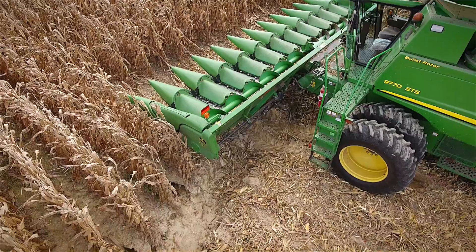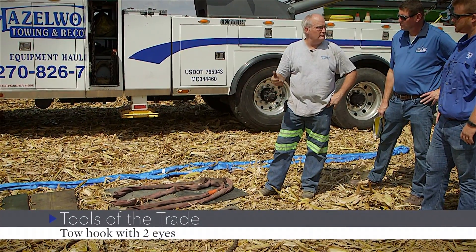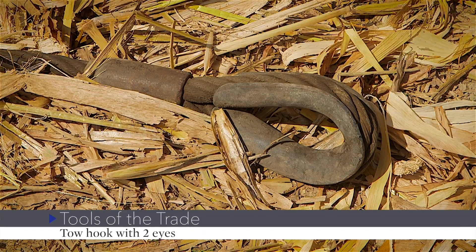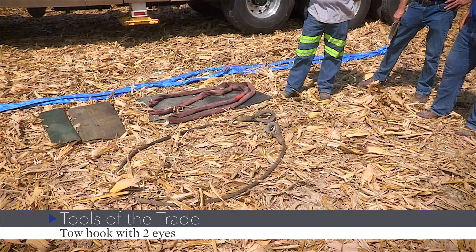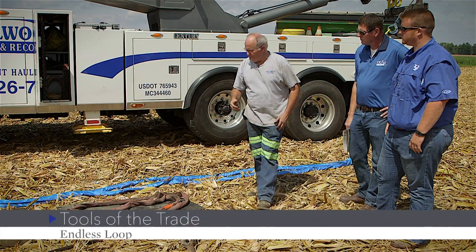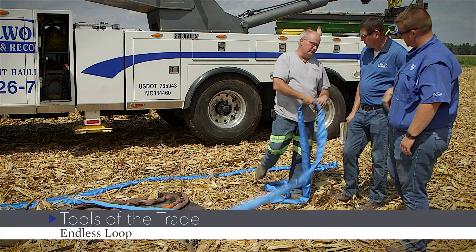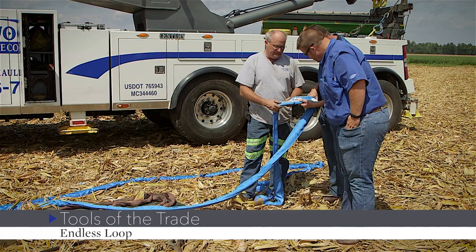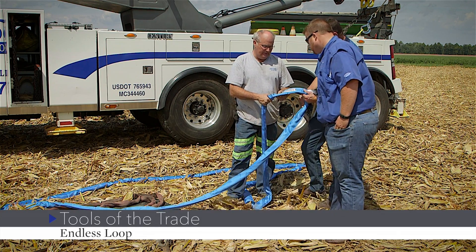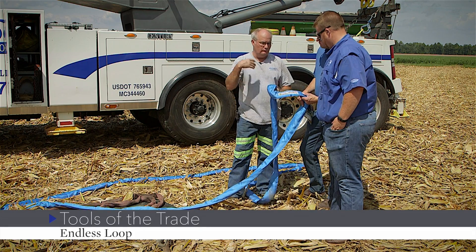To wrap up our extraction exercise, let's look at the tools of the trade. If a piece of equipment doesn't have a draw hook or something attached to the front, you need to go around an axle — usually after digging out. Since you can't push a chain, you slide this around the axle, put a clevis in it, hook to the snatch block, and pull from there. We also have what's called an endless loop strap. While the flat strap in basket form was rated at 33.5, this endless loop is lighter, easier to maneuver, and rated at 42,400 pounds in basket configuration. They're much stronger and more versatile — you can throw them around axles or around anything accessible.